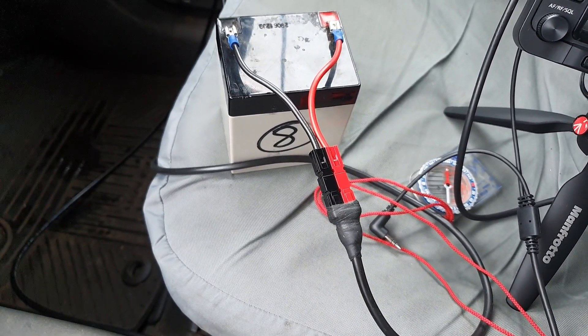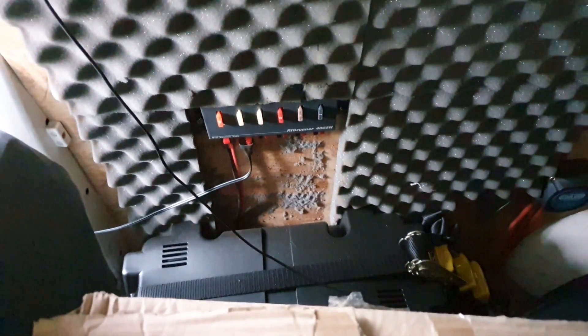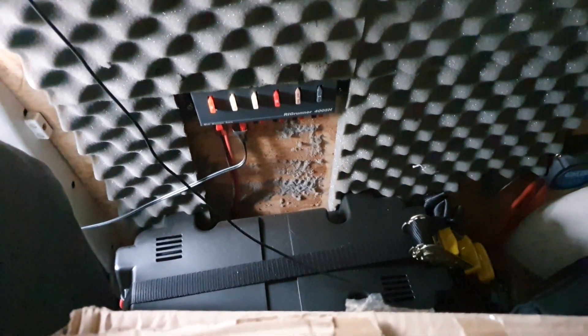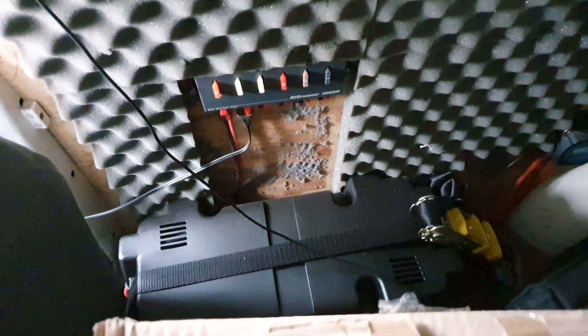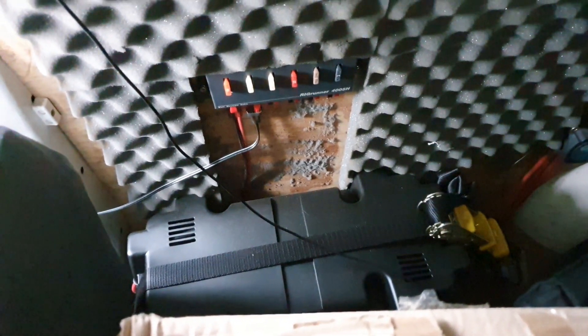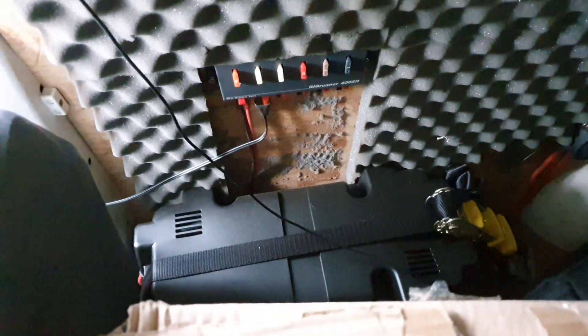The radio is set to 10 watts and it's running off my leisure battery. That black box is a 100/110-amp NCC Class B leisure battery, with a connection into this PowerPole distribution unit. There's a 40-amp input on the left and the IC-705 power cable is second from the left — that's how we're powering the radio, along with a number of other power sockets.